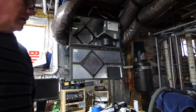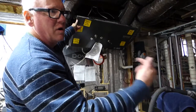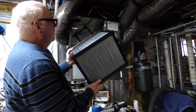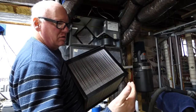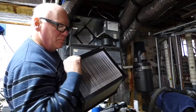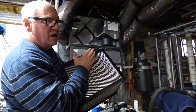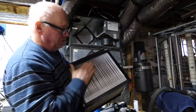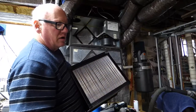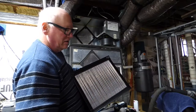That's the HRV right there. It brings cold air in, takes the stale warm air out, and passes them through this heat exchanger. The airflow going through on its way out doesn't mix with the airflow coming in. But what does happen is the heat from the outgoing air passes through this aluminum — because it conducts heat very well — and it warms the incoming cold air, so that we recover some of the money we spent heating the air inside the conditioned space.